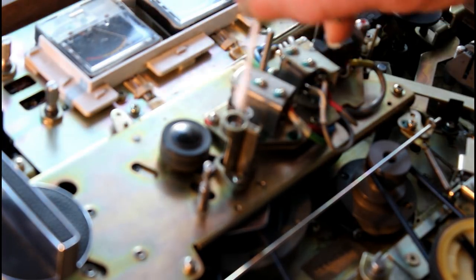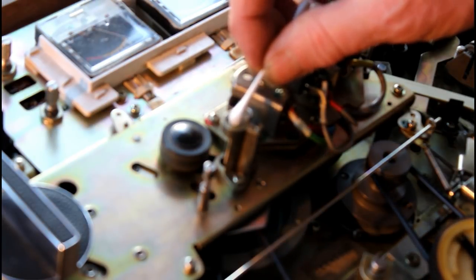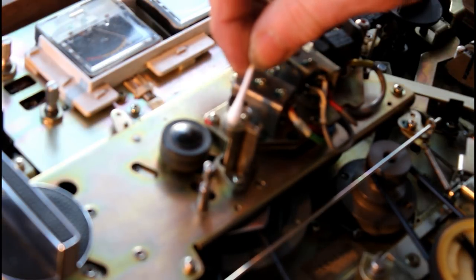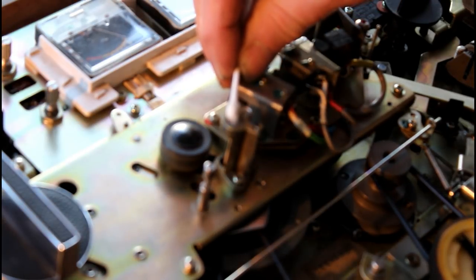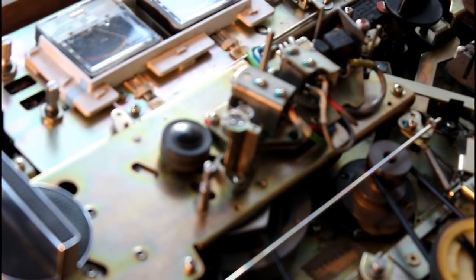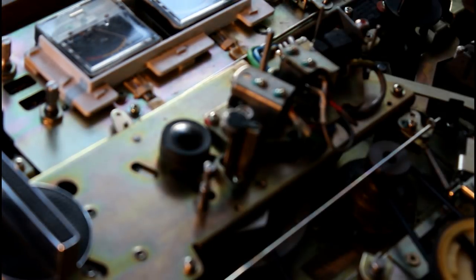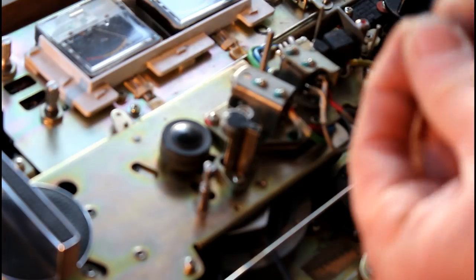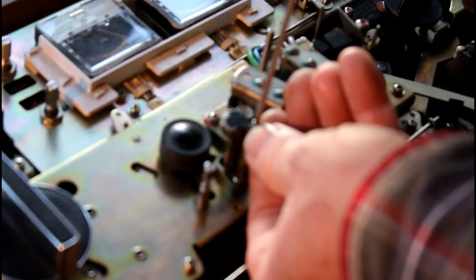And on the top here, there's a cover which I've just taken off, and I'm going to put a little bit of grease in there, which will just be left in there, and that will lubricate that bearing. You don't want to put oil in there because it will run down the shaft, but the grease should stay in place. And then there was this little cap that goes on, and a very small screw that will probably require a special screwdriver. It's a tiny little screwdriver.